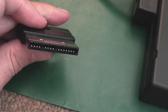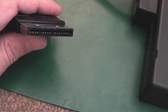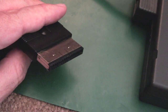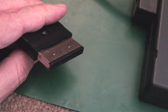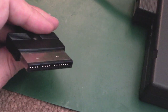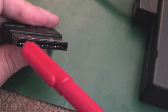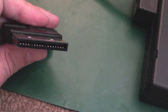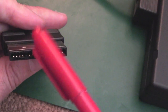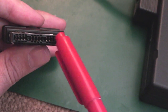It's an interesting point actually that I'll make: certainly on cartridge-based systems like my MVS cards, for example, if I just leave them for a few months and then come to use them, they've always oxidised. No matter how I've cleaned them in the past, they've always got oxidisation. What I did recently is that one of them I cleaned, instead of cleaning with just IPA, with IPA and then I used a bit of WD-40, and that particular cart has not re-oxidised, and the cart works fine. So maybe you should consider putting something like that on connections like this, despite the fact it's got a very, very small amount of oil in there.